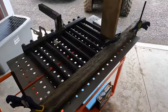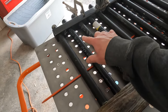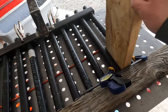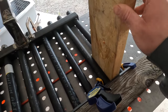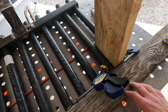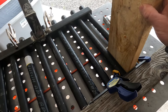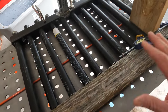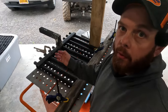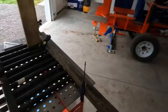Here's what I've come up with. I've got this 2x4 clamped down to the welding table, with 16 inches between the edge of the 2x4 and the edge of the square tubing. As long as I keep the bars tight to this 2x4 as I tack them, everything should be good. A 2x6 is the perfect spacer to use on the opposite end — I can just clamp it in between and tack everything into place. It works out to an inch and a half in between. As a height spacer, I'm using a fiberglass driveway stake you get at a tractor supply — it's almost the right height, a little tall, but nobody's going to notice.